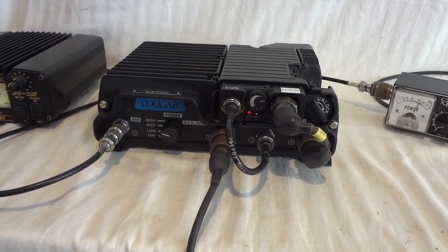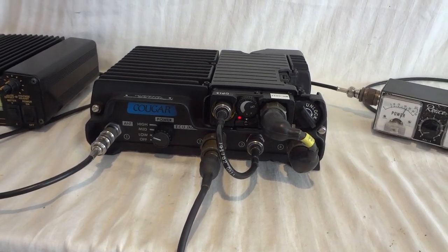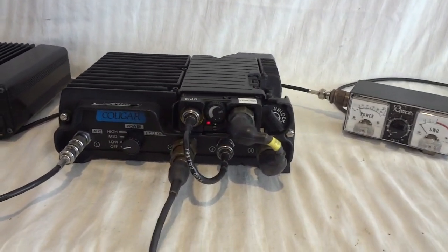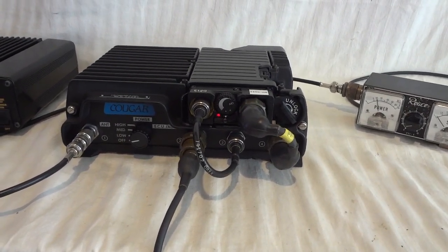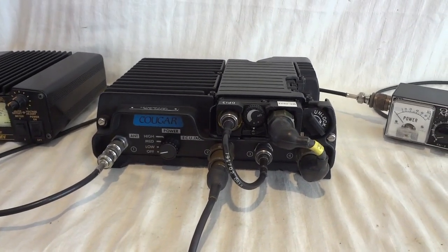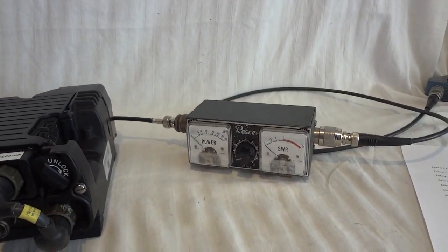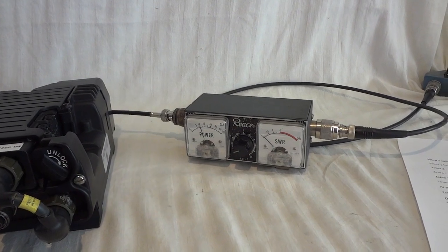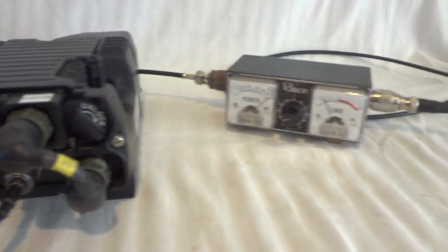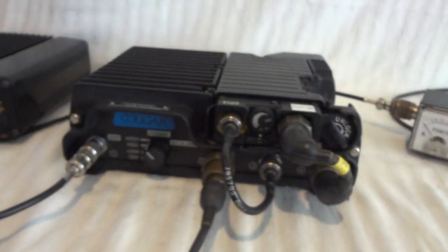All right, that's good. I'll switch to the lowest power. That's basically the radio without the vehicle adapter being active, so that's only the handset. Hang on. All right, this is lowest power. How does this sound, over? Zebra 2 returning. It's about 5x5. Good copy, but some noise starts to creep in. But don't forget, I'm only using the small rubber duck on this HT at the moment. Over. Zebra 1 for Zebra 2, okay, I understand. I'll go back to 20, hang on for a second. Alright, I'm back on 20 watts now. Is the noise gone now, over? Yep, it's noise free, works excellent, over.